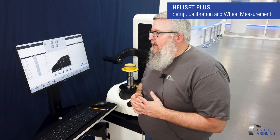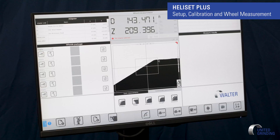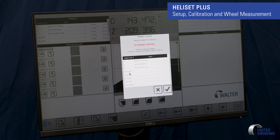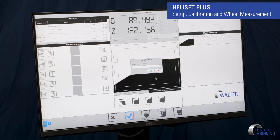If I'm just wanting some numbers off the wheel, I can come in here and measure the wheel. If I want the diameter for an 11B5 — because I want this intersection point of this diameter — I can go into constructed measurements and ask for a diameter. It's going to ask me to pick a wheel arbor, so I can pick the 'Training HSK' and click check. First it's going to ask me for two points, so I'll go point here, point here across the top. Then it wants two more points on my angle — it gives me my intersection and my check mark pops up. So now I can select my check mark, it'll give me my diameter. Now all I'm doing is taking measurements, so if I wanted to give a wheel pack name I could, but for what I want — just a quick measurement — I'll just hit X.